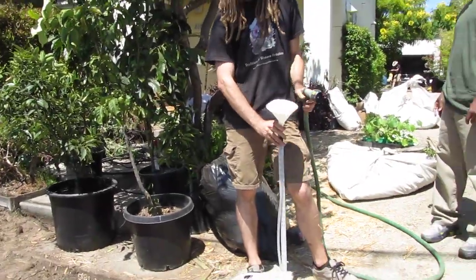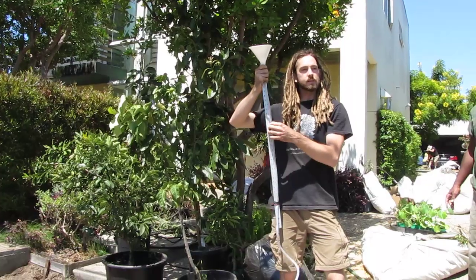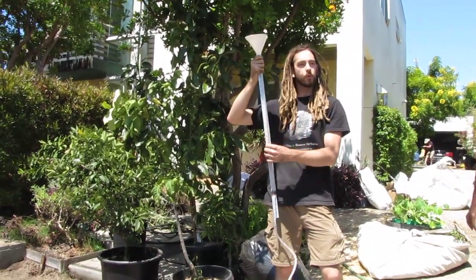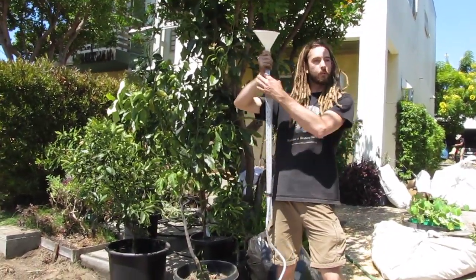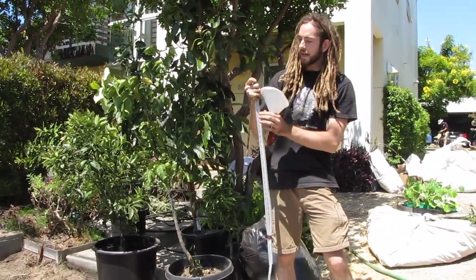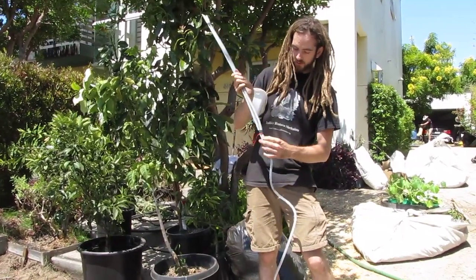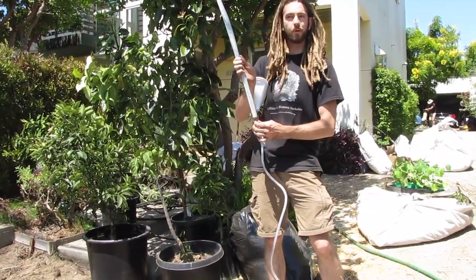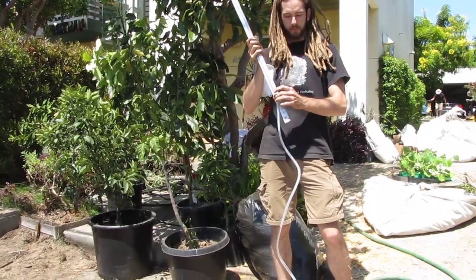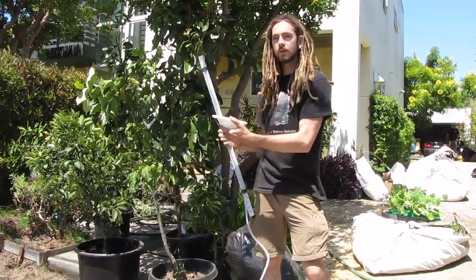Yeah, so basically, we've got this tubing, different lengths or thicknesses are okay. Clear's nice, so you can see through it, because eventually you need to see bubble movement. What you do is take the ends of it and attach it to a ruler. You want to be careful not to pinch it too hard. I got some pinches here, so if I were to redo this, you do it where the pinches change where the bubble location is going to be. It restricts the flow of the water.